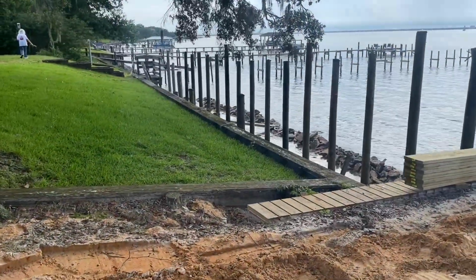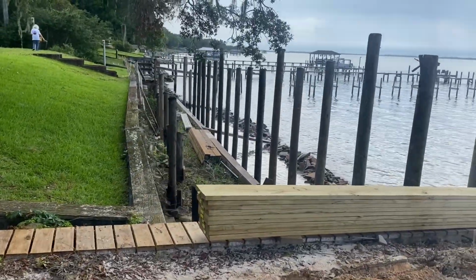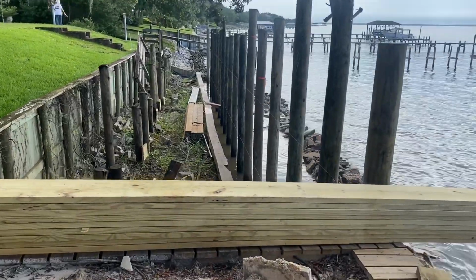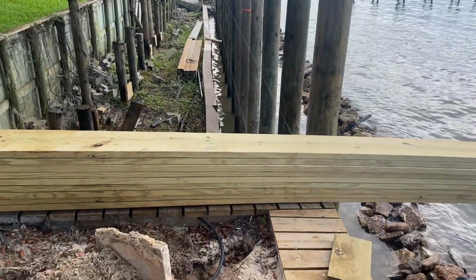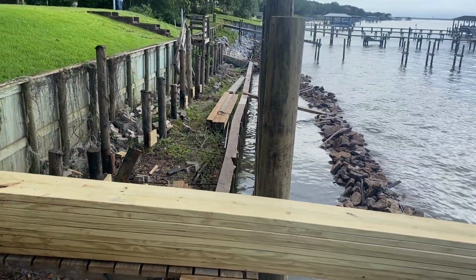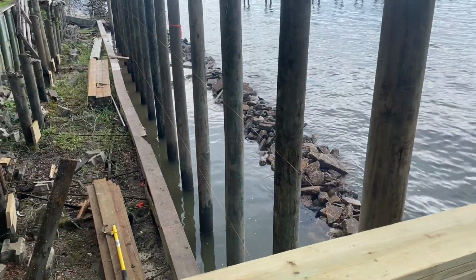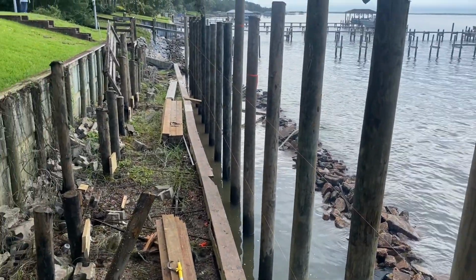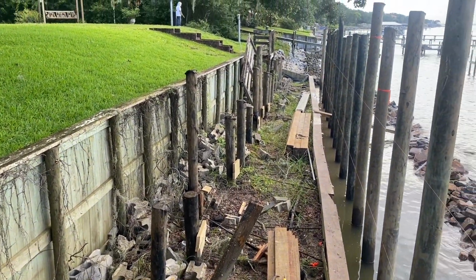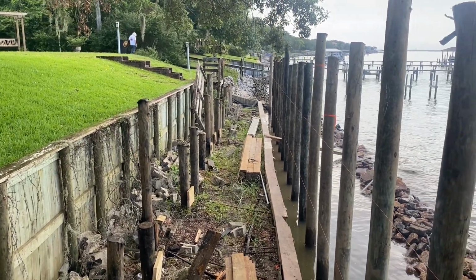Built the seawall. Made some really great progress over here today, in the past couple days actually. Got 18 of the 30-foot pilings set for the navy style wall. They're 8-inch tip pilings. We went just outside of the old wall there and connected to the existing wall we built here last year. We'll be installing two sets of triple 2x8 whalers on this tomorrow, and then we'll get started with the vinyl. Already got our deadman pilings in place on the back side, so we'll run some 5/8 type 316 stainless steel rods down to them, get this wall tied back real good and secure.